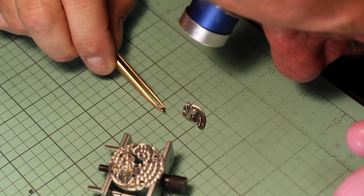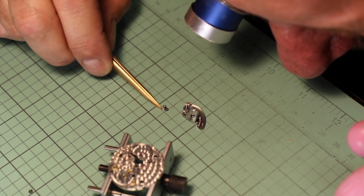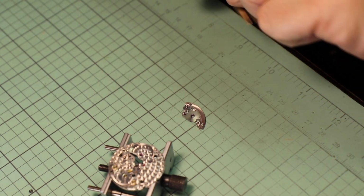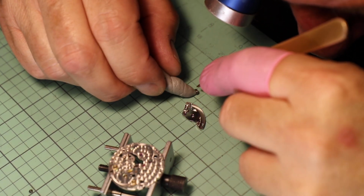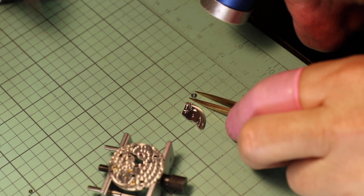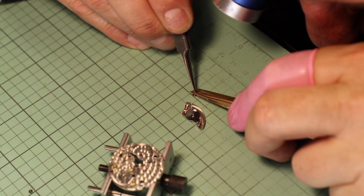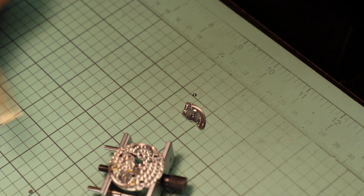And here you go. This guy pivots like this. He pivots. Okay. And he locks up against the ratchet wheel, even though we have a click. So we'll take the click off. Now this particular gear has a bushing core too, right here. So we'll slide him off. He needs to be cleaned, and they develop dirt.